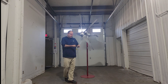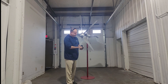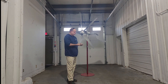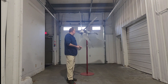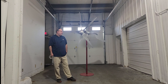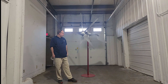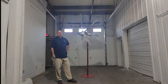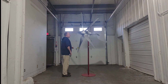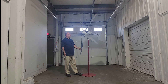This will need to be welded up to a heavy pipe. We do not like the shaft coupling stuff — I've been doing this for many years and I've seen stuff come off and go sticking out of the ground. We do not want heavy wind turbines to fall down and hurt people, so get these things as rigid as you can. The wobble out of the top of the pole means you're losing power. Storms can come through and tear things up, so if you're not able to get these things down in the event of a storm, especially when they get this big, it's very important to spend some money and build a good tower.